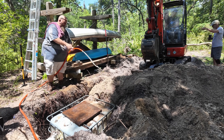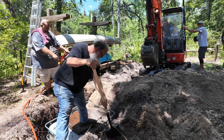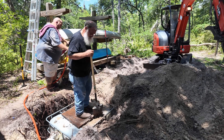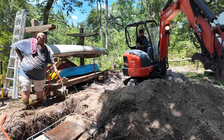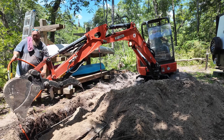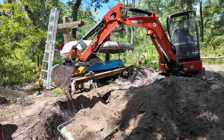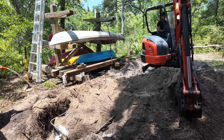The reason you see us using a garden hose over the dirt is to flush out any air pockets that may be underneath the tote, so nothing is sitting in there, nothing is going to cave it in, and it's going to pack in properly. We just take it slow to make sure we don't crush anything — this excavator is definitely not forgiving if you hit something with it.